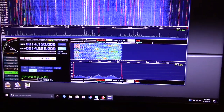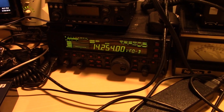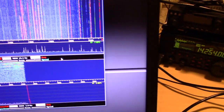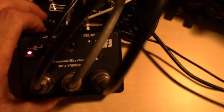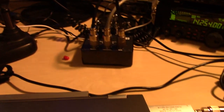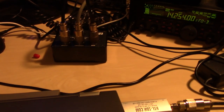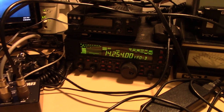Now how do you get 100 watts on output using something like this for a receiver? I have my radio tuned to the same frequency. What I can do is use the MFJ 1708 SDR switch box — transmit and receive for SDR. I'm going to show you how I hooked it up and what it does to give you this kind of SDR with a full 100-watt radio that you already have, and a couple of them together, without buying an SDR radio. Let's check it out.